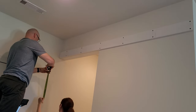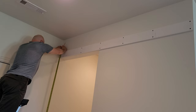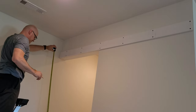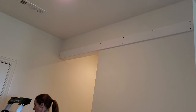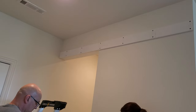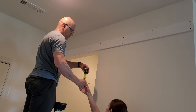At this point, we are going to mark all of our spots to install the rail. We're measuring from the floor all the way up to the header — the measurement we determined from the beginning, which is door height plus one and three quarters inch. We're going to make our way all the way across the header and mark those spots, and then draw a line connecting all of them. This helps make sure our rail is perfectly level and straight, and makes the next steps much easier.